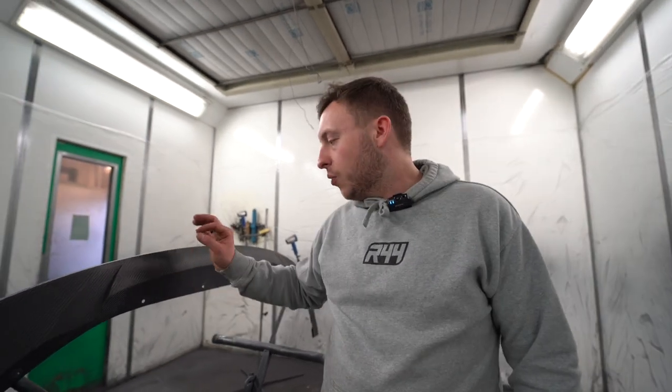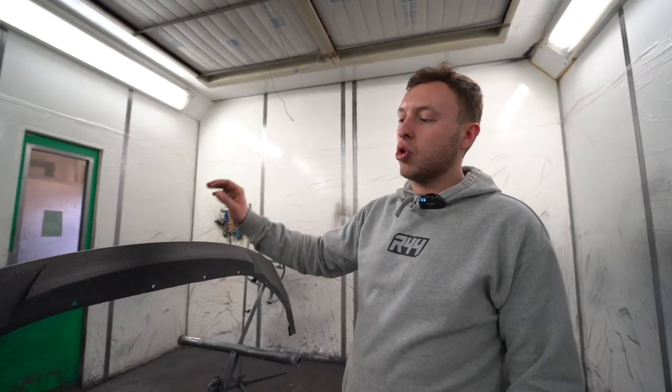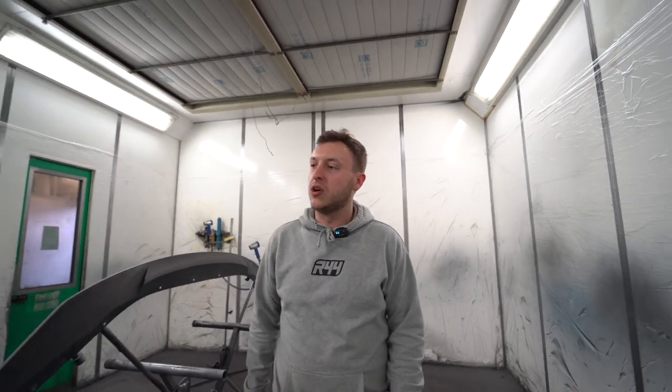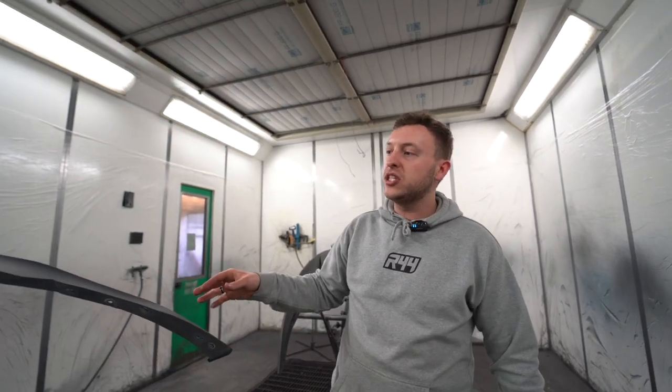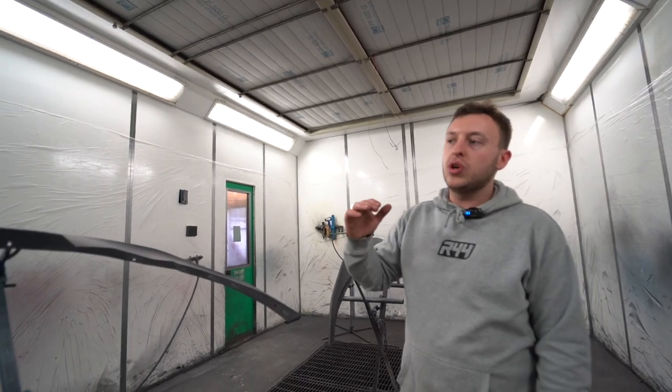Any pinholes, we fill them up with a bit more resin, and then just finish them up. So this is a raw splitter ready for the first coat. Behind us, if you want to go here, Dylan, let's go here. This has had one coat, so each splitter gets two coats because we want the lacquer finish to be really, really like a mirror finish.